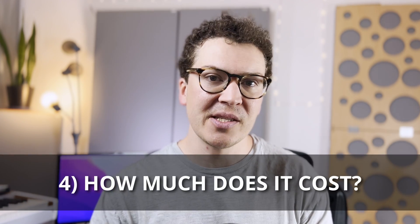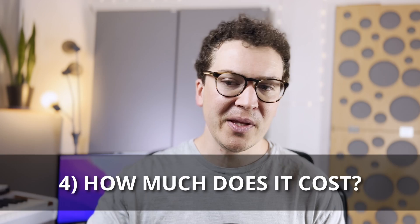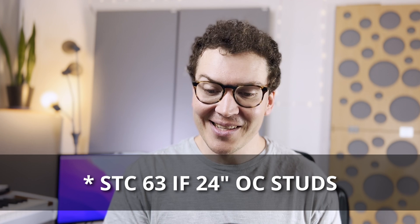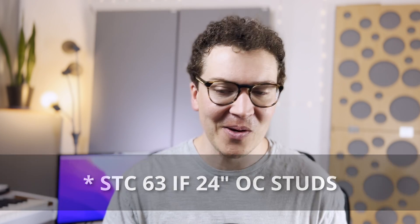The question you've probably been wanting to know: what does it cost, and how does it compare to not using Silent FX drywall? We know that if we use Silent FX drywall we get roughly the same STC rating, but it is worse — STC 62 versus STC 63. So you're going to get slightly worse results than using two layers of regular drywall. The only benefit would be if it costs less or was easier to install.